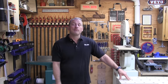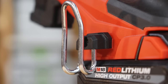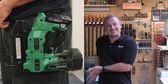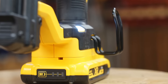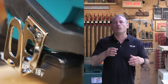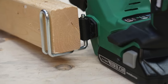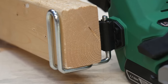Milwaukee and DeWalt had the easiest maneuverability, based on weight and evenly distributed balance and size. For belt clips, Milwaukee had the easiest clip to hook on, with a slight outward curve that assists sliding over your belt. All nailers hung the same way once clipped. Milwaukee and DeWalt use a wire star-style clip; DeWalt's is a bit thinner. Makita has a low-profile thin plate metal style that's hard to hook on a belt. Metabo HPT has an inch-and-a-half wide massive clip that stuck out way too far.